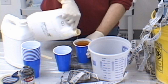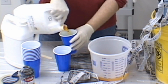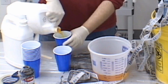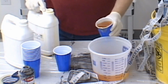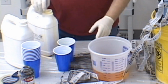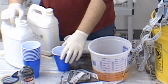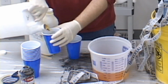After placing the mold in a plastic bucket to hold it upright, we then mix our casting resin. We are using a fast cast resin that uses equal parts of part A as well as part B to create a proper mix. Make sure you have enough resin on hand to pour the casting in one continuous pour. Also, please be very careful that you use equal amounts of part A and part B of the casting resin. This is a 1-to-1 mix by volume casting material.